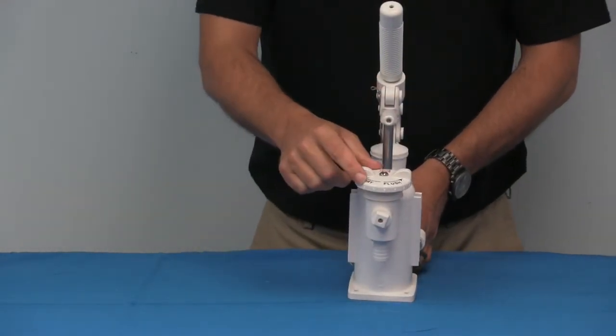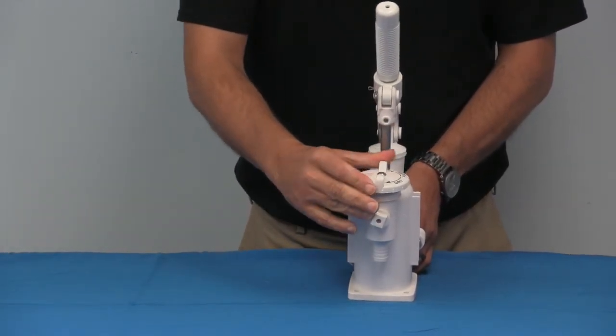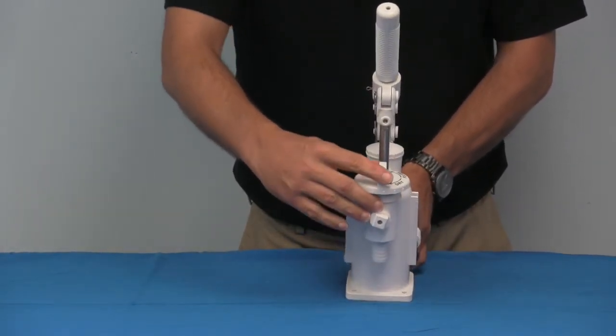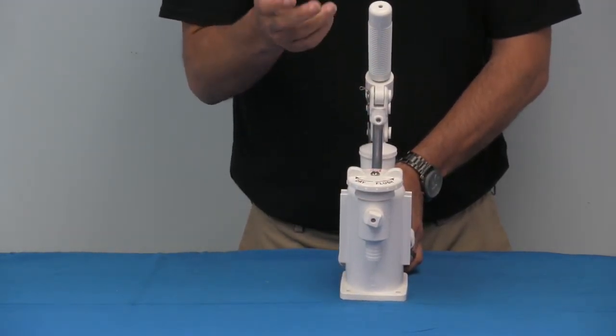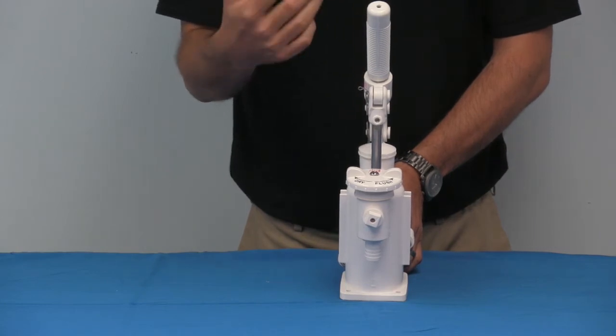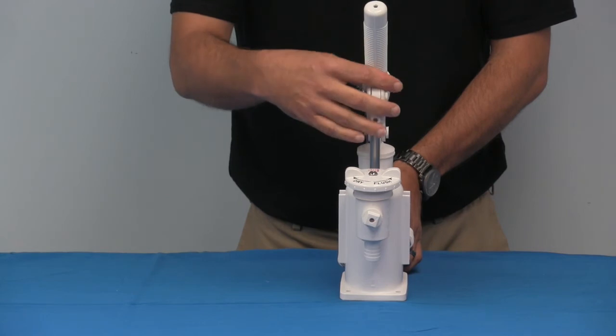This has a flush and a dry flush option. Normally when we're flushing the toilet, we're going to be in the flush position. To move to the dry position, you simply turn it back, you pump the toilet, and it will take the contents that are in the bowl out. This means that you won't have any water sloshing in the bowl while the boat is rocking and things like that.